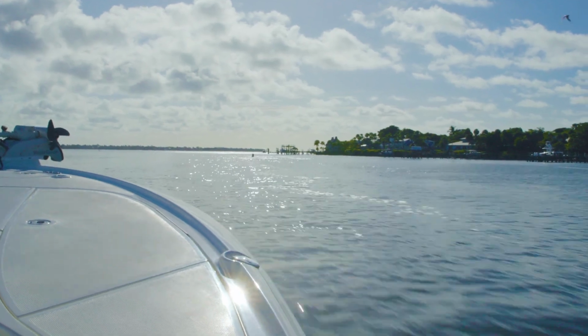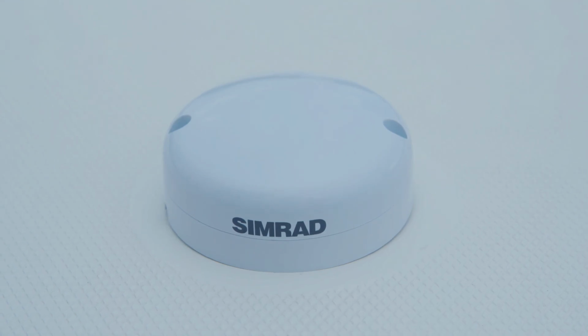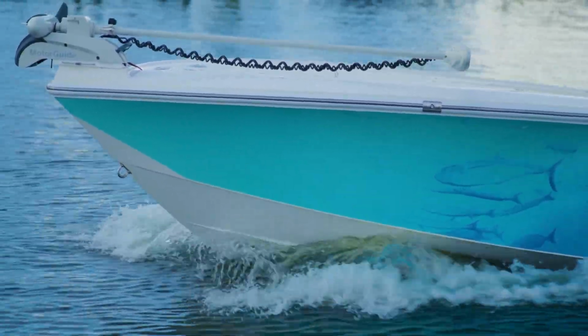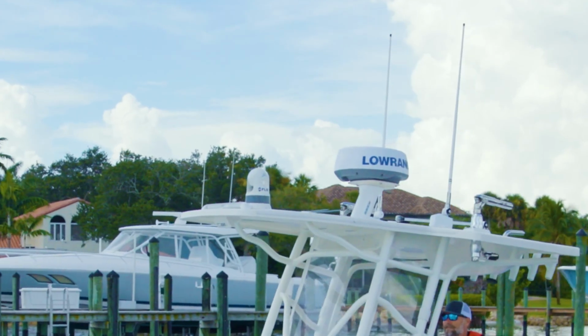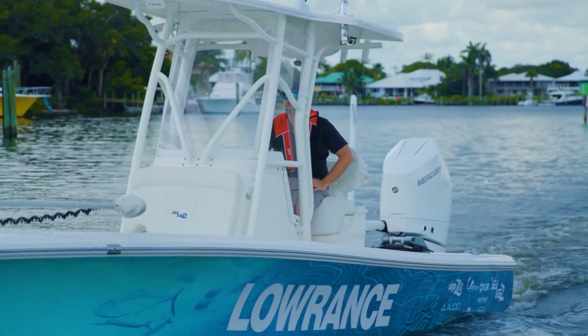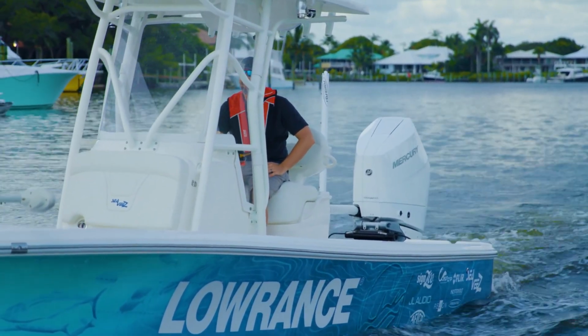The Pro Control IMU receives satellite GPS data and measures multiple performance factors on board the vessel, including pitch, roll, yaw, and speed. The IMU should be mounted in an area subject to as little excess vibration as possible, with the arrow on top of the unit pointed towards the bow of the vessel. The IMU must receive GPS signal to function and must also be located an adequate distance away from other onboard items so as not to receive electromagnetic interference.